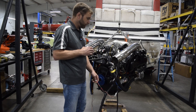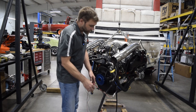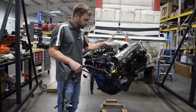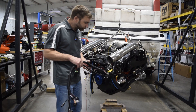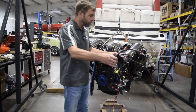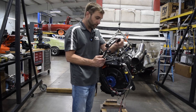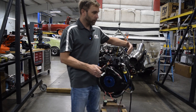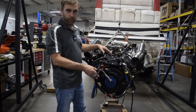When we do a combination for you, the more turnkey the better. Whether we're doing the rigging in the boat or not, you can ask to have it wired and cleaned up to fit the motor nicely, including the harness for your alternator, all the gauges on the dash, etc. We can do it one of two ways. In this case, the customer had already mounted the ECU off of the engine, so we have our ECU plugs and the MSD plug — super simple. The ECU is remotely mounted inside the boat, off the transom or to the side — nice, simple, and easy to install.